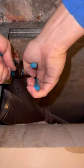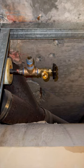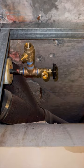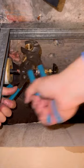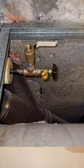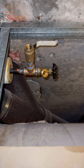Once the system was offline and the water was shut off, we started preparing for the connection. I cut the old hose bib off with the grinder — it's faster and easier, and the cut is always perfect, it just needs to be reamed after. The only problem with using a grinder to cut copper is that particles spread out, so you need to wear goggles. I reamed the pipe and stuck a paper towel inside to suck the water out, then cleaned it, fluxed it, and installed a half-inch male adapter. Even with a bit of water dripping, the adapter was soldered successfully because the water evaporated before reaching it.